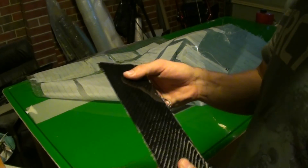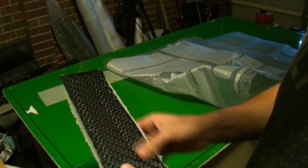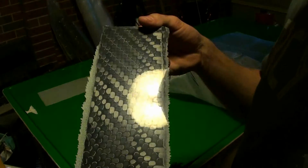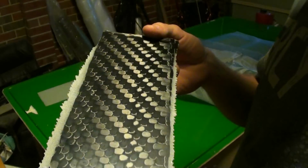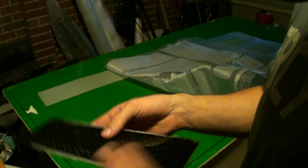Alright. Yeah. Oh, got me worried for a second there. Just a bit of cracked off resin. Yep. Totally awesome. There is the slightest hint of where the core is at the back, but that's mainly because I need a better slant on there. I'd say that's about 45 degrees or something, but if I had more of a slant, I think a smoother transition, that shouldn't happen, I'm pretty confident.